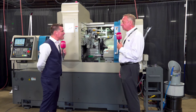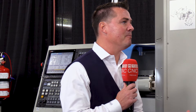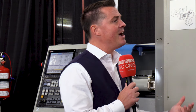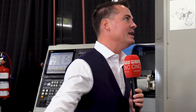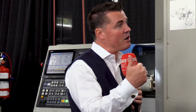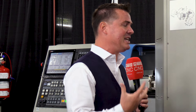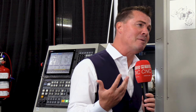It's really making sense. We started with being able to do complex parts, and even if they're not complex, finishing a part off the machine so we don't have to move it. Now we're balancing thermal expansion so we're not having to check every one, every five, every ten parts — which would be the equivalent of shutting down the machine because we don't want to make scrap parts. That removes downtime. Plus better finishes, so maybe no secondary grinding operation, and longer tool life — saving money there as well.